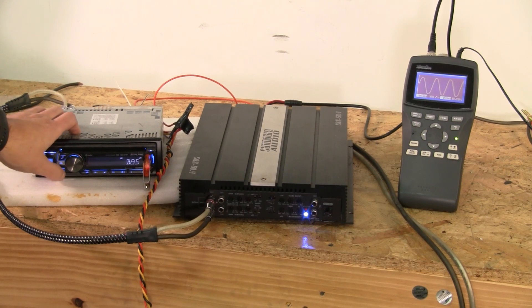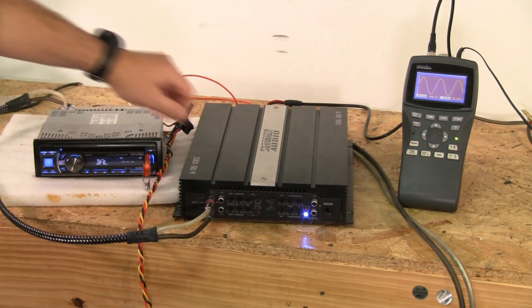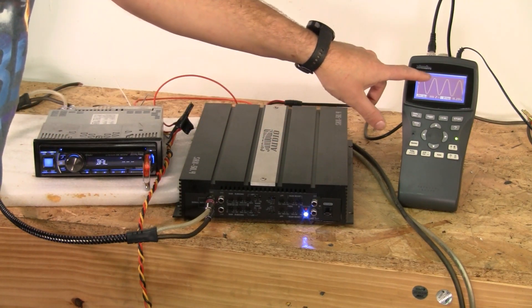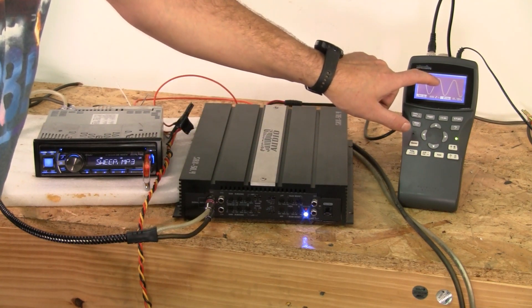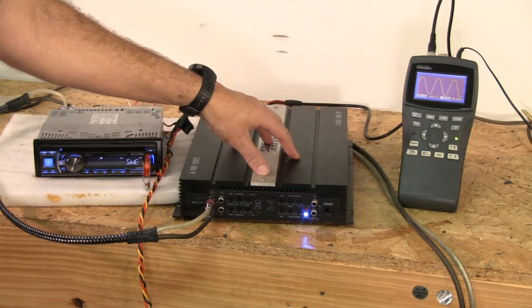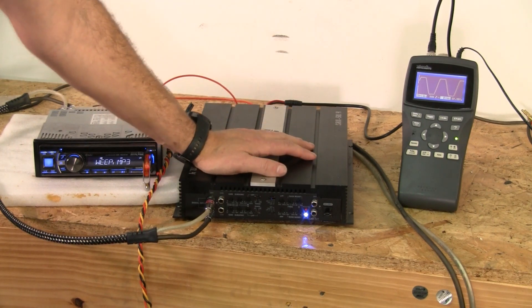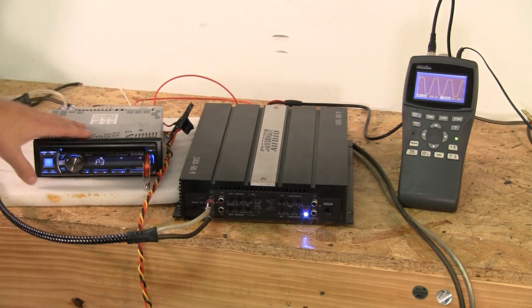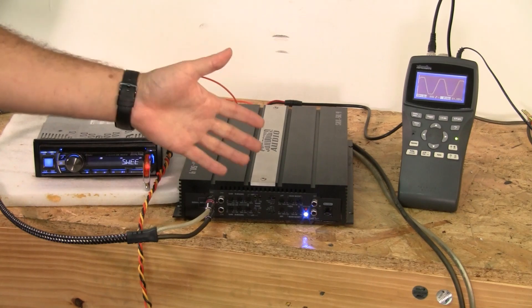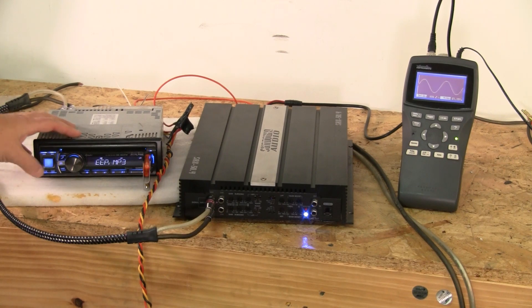We turn the bass back and try treble. When the sweep gets up to that high point, you see it clip again — we start clipping and then it's into a hard clip. So it's not just bass that will do that; it's any frequency shift — bass, mid, or treble, anything in between. If we had just picked one kilohertz or 40 Hz as our test tone, that would not have revealed the treble clipping. That's exactly why we use the full sweep.